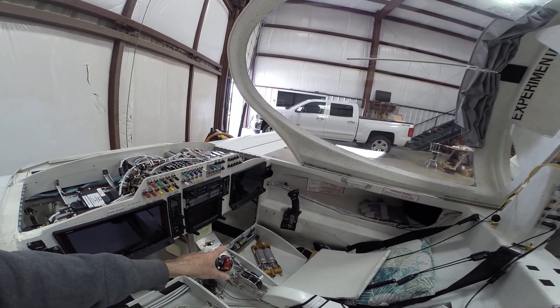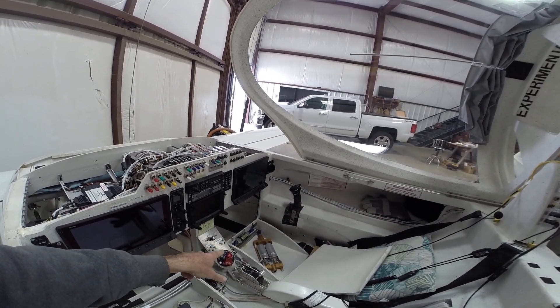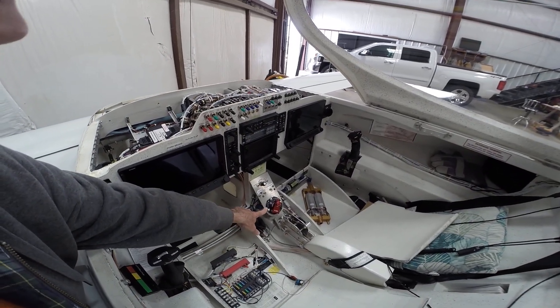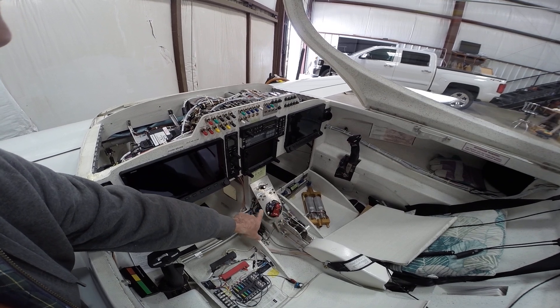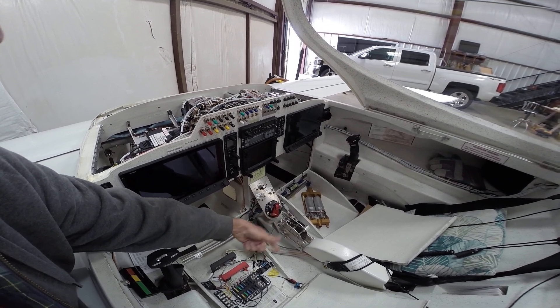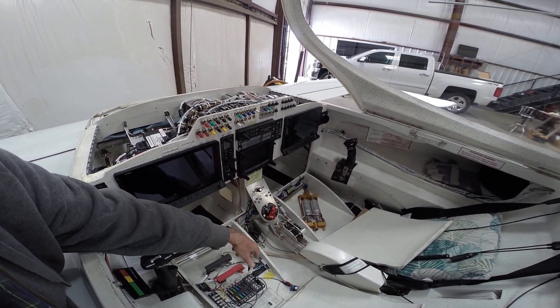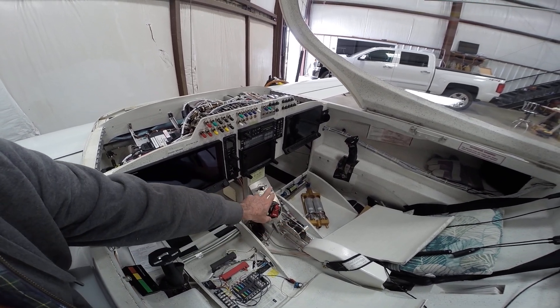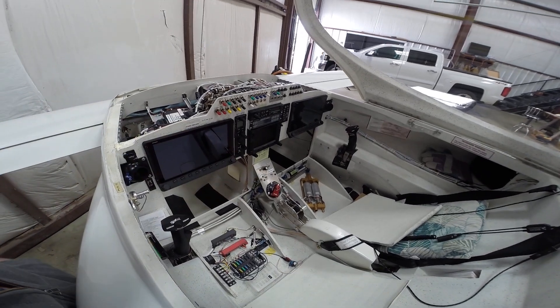There are the SDS fuel pumps with a Holley 40-micron 100-gallon-per-hour filter. This is a dual-gang fuel selector, because with electronic fuel injection the return fuel needs to be switched back to the source tank. Just a throttle lever — the mixture control is electronic.